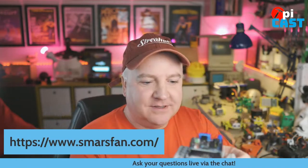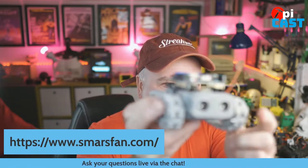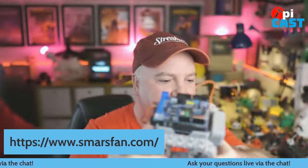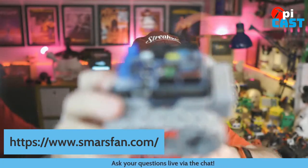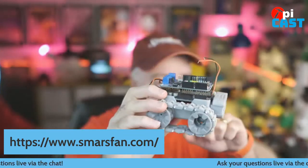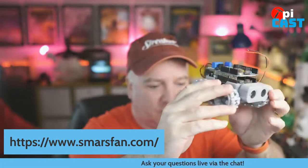There wasn't a lot out there, so that's why I created the SMARS fan website. SMARS are these little robots. This is the first one I built — a tiny, cute robot. It's got a little range finder as its eyes, and it has an Arduino and a little shield on top with all the motor controllers. It has a 9-volt battery inside and everything is 3D printed — all the tracks — and it uses little N20 motors. Really easy to wire up and get working, very satisfying.